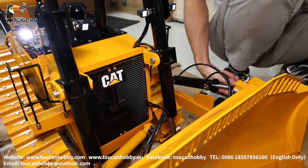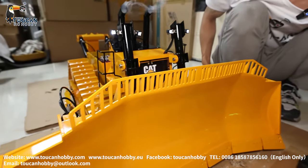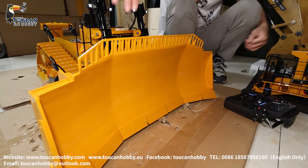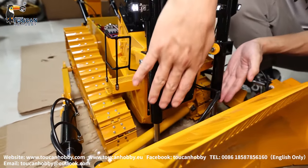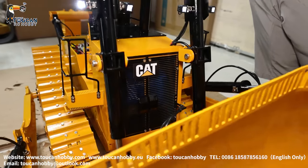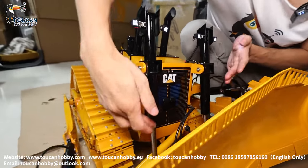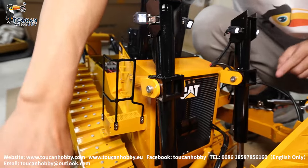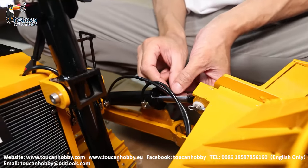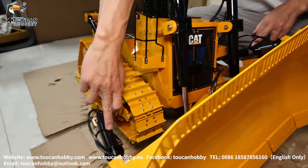For mix control, I'm using J3 to control both cylinders moving together for lifting up and down. If not using mix control, I use the turning switch for tilting left and right. For tilting left and right, you can tilt with one cylinder or with two cylinders working together in different directions. When I tilt in one direction, notice: this cylinder goes out while this cylinder comes back — but I was not operating those two cylinders. This cylinder's piston goes in and this side's connecting rod comes out. The valve was not opening; I only operated this two-cylinder valve.